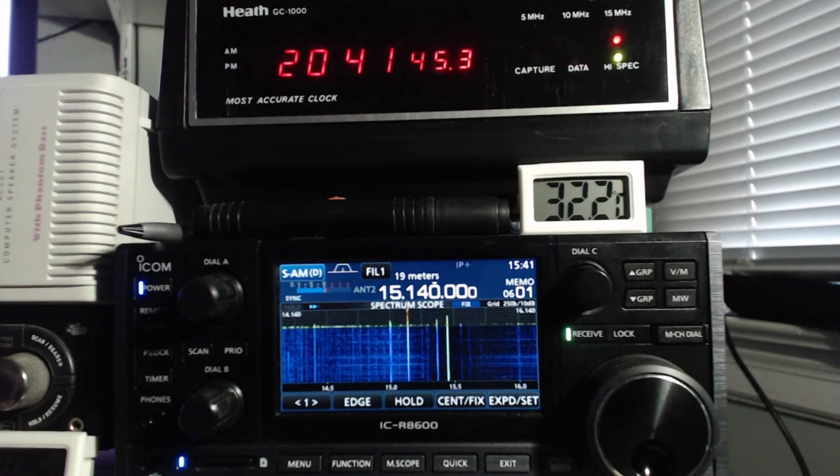Many present-day medium-price multiband ham radio transceivers include the 50 MHz band for both receiving and transmitting. For working sporadic E DX, a simple half-wave wire dipole set with 50-ohm coax cable and sloped at a 30 to 45-degree angle will pick up signals and let you work some stations. A really significant improvement will be achieved when you install at least a three-element Yagi on a mast or tower with a rotor to point the antenna toward the direction from which signals are arriving.